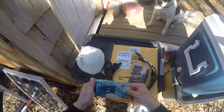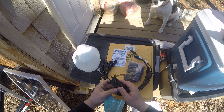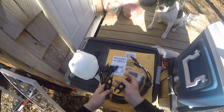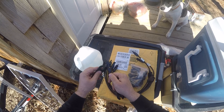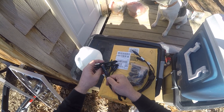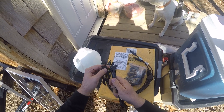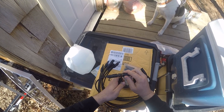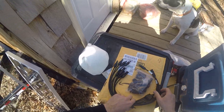These things here are pretty handy — these are MC4 connector wrenches. You can use them to take these connectors apart or tighten them up and put them together, depending on what you're doing and what size connectors you have. And they're pretty handy. These connectors have these little ears in here when they snap together and you can use them to take those apart, which we'll probably see here in just a second.